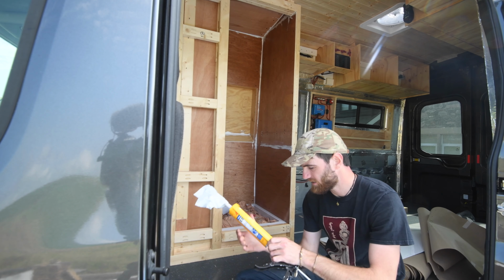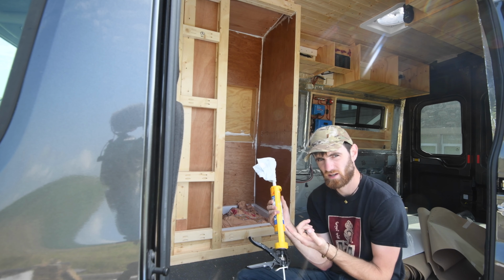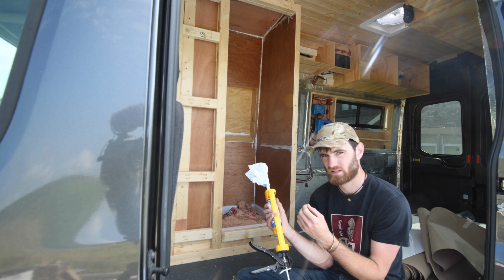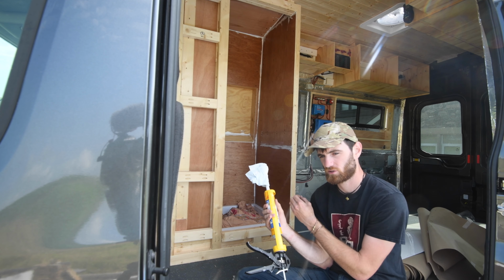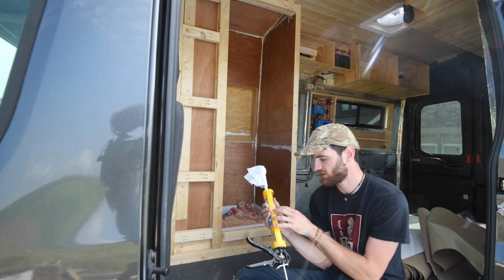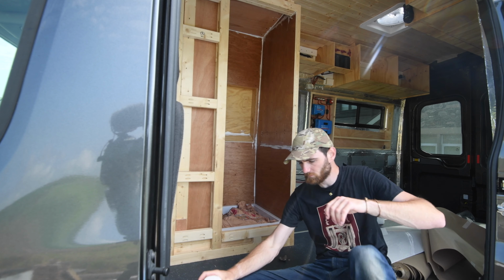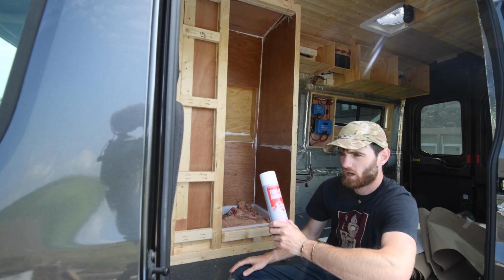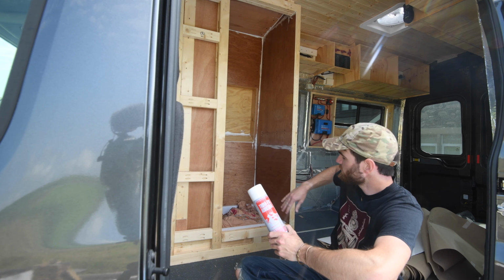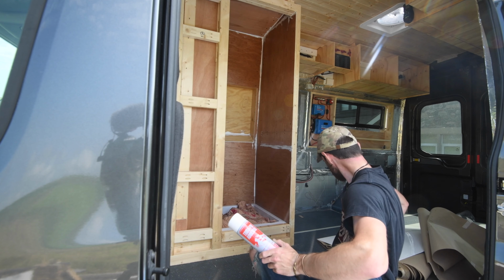The way I see it is that if you do lines of sealant, there's probably only 20 to 30% or less of the actual PVC material adhered to the surface you're putting it on. It's only adhering where you've put the sealant, and that isn't 100% anywhere near. So with trim fix, I'm going to have 100% of the surface sealed on there. And the reason I'm doing sealant around the edges is just a bit of extra waterproofing.